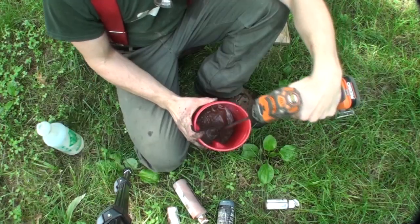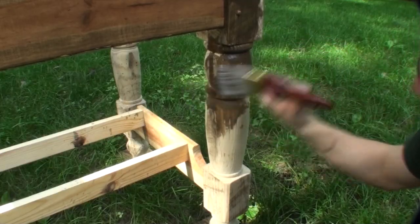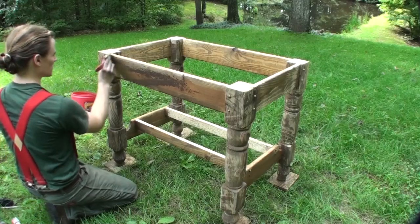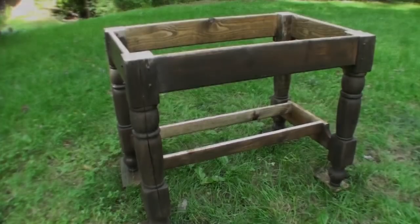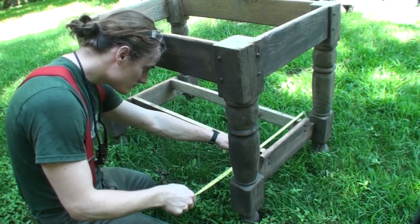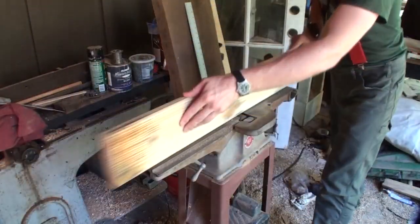To add color to this piece I do something that maybe most people might sneer at — I just use small tubes of acrylic paints to tint up whatever I need. Instead of having one-color stains or a bunch of stuff sitting around, I just have these various tubes of paint. I do mainly water-based finishes and I like the control of being able to tint it and change it as I go. It started out light and I built up the color as I went. For the top, it had some termite holes or bug holes, so I filled those with some plastic wood filler.